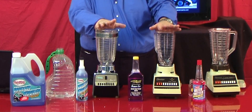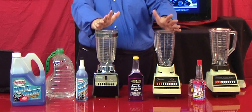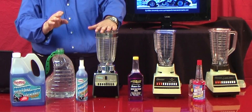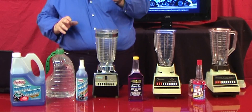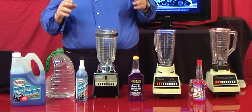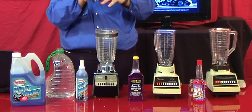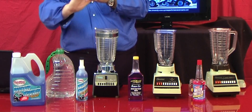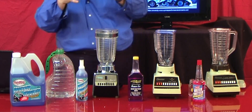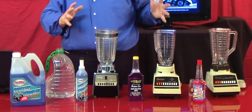What we're doing here today is to concentrate on foam prevention. The reason it's so important is because foam — when you have an air bubble — it has 10 times the amount of compressibility of the fluid and it causes problems. You're always going to be making air bubbles in your hot spot areas, because in an engine some places are really hot, like in the cylinder head area and the exhaust area, and then other places are really cool. So you're always going to be having bubbles.